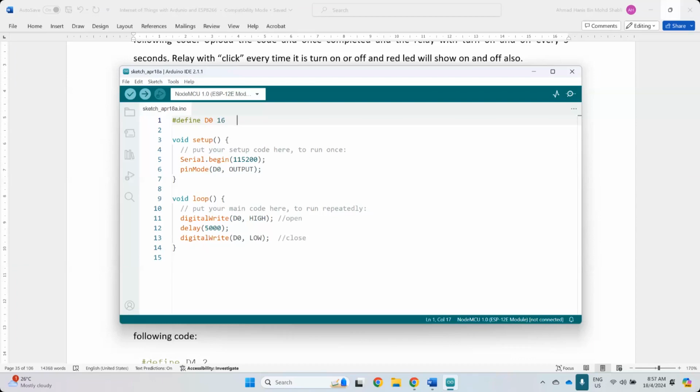Make sure that when you connect all these pins, you are sure, like this one is 3.3. This one is ground. So this cable is the ground cable. Make sure that you connect it to the correct pin, properly. You have to confirm, double confirm. Don't reverse.